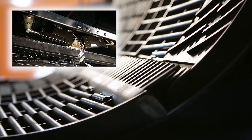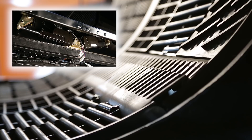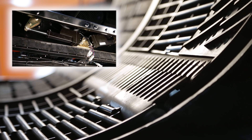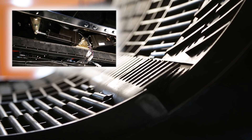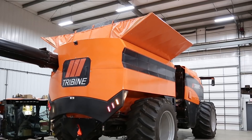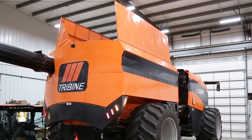With the concaves, the implementation on the CAN system requires two extending while the third is retracting, or vice versa if we're going the other direction. Because of them being on the CAN bus, that is easily achieved due to the way they internally provide feedback for their position. Trying to do that with an H-bridge — stopping motion and changing direction — would have been much more through hardware than software and a lot more difficult. With an HD unit over the network bus, all the information is available: power is provided to the unit, a position is given for it to drive to, and that feedback is available instantaneously off the actuator.